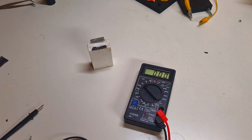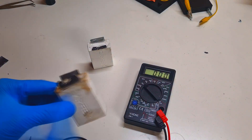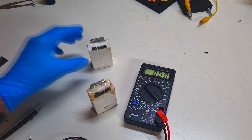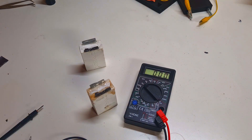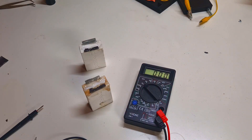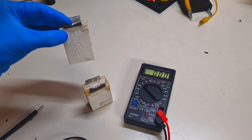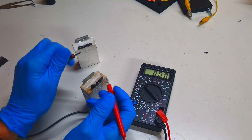To make sure I get the right data from this cell, I made a second cell. The chemistry and cell design are the same as this one — same chemistry, same cell design. The only difference is that this second test cell was made three days later. So this first one is 40 days old and this second one is 37 days old. On the first day when I charged this second cell, I got a cell voltage of 2.10 volts. After 37 days, let's see what voltage I will get.